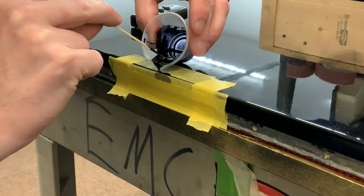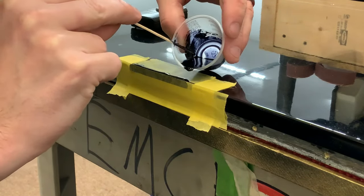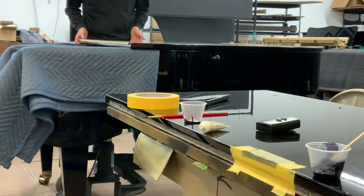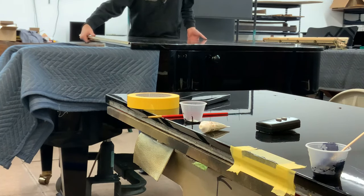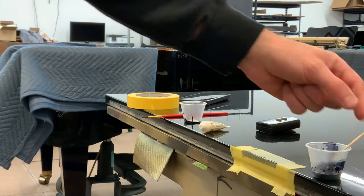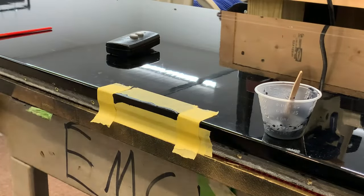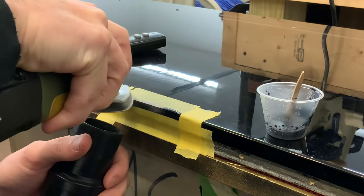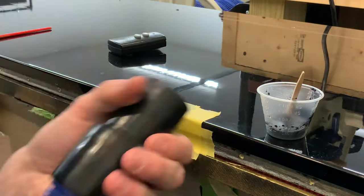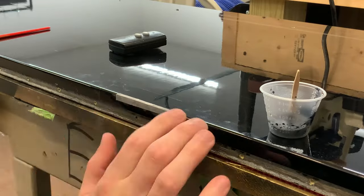So I've mixed the dye into the polyester resin, and then the catalyst in there. You'll see later, between adding too much catalyst and the water, you warm up the polyester just a little bit so the air bubbles can escape. Well, if you warm it up too much, the chemical reaction happens a lot faster, and then the bubbles aren't allowed to escape because it cures so fast, which is what happened in this case. As you'll see, midway through the sanding, you can see some bubbles, but I'm not going to redo it because it's on the edge and nobody's going to notice it. It'll look good when it's done.